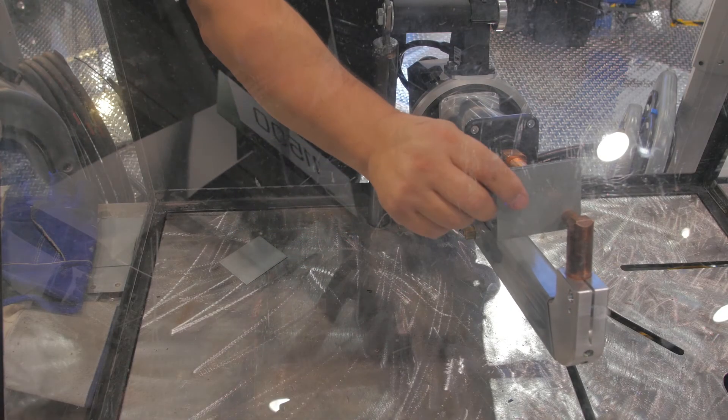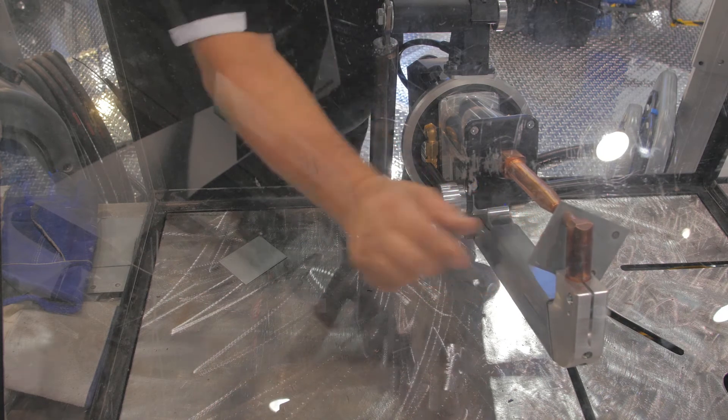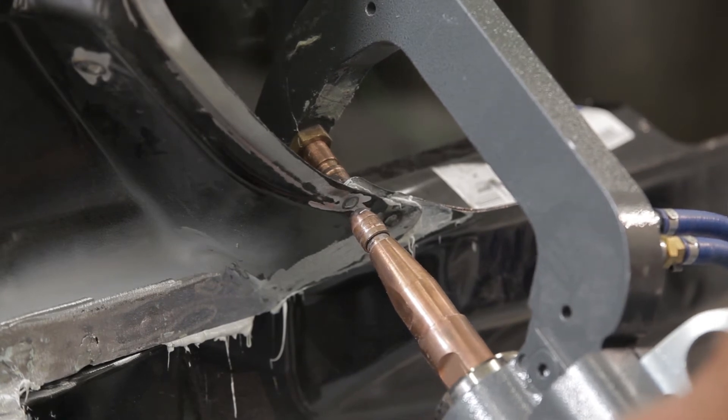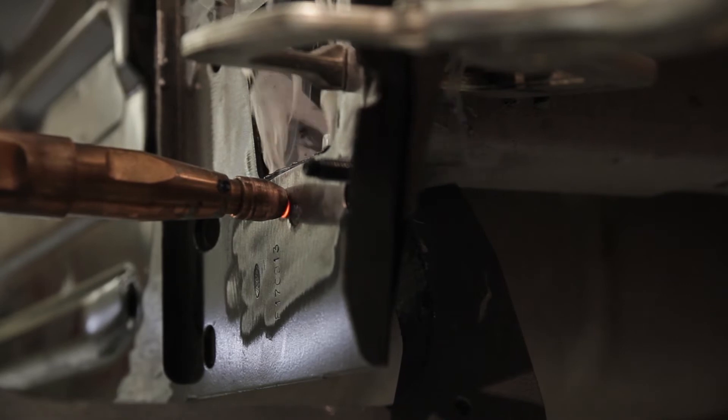Is doing test welds something common in your shop, or does a guy just jump on a car? Prior to Toby coming out — he's been out to our place a few times — one of the most important things he brought up is that whenever you see videos of OEMs or any manufacturing facility, you see sparks flying during a spot weld. Some technicians automatically think that's indicative of a good weld. But Toby has made clear that when you're doing a spot weld and sparks are flying, that's not good. You'd be surprised how many people don't know that — they think it's okay.